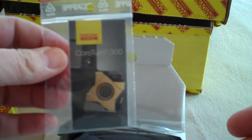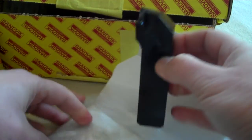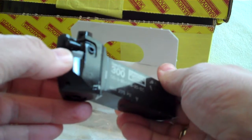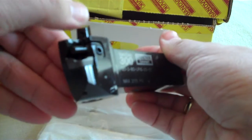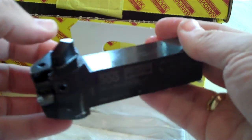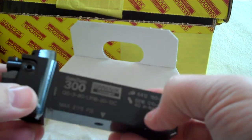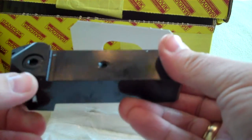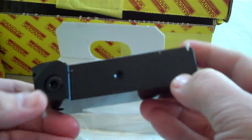A little instruction manual and the tool itself. Here's the unique shim with the under coolant, and the over coolant jet nozzle up here. The part number is laser marked on there, with the screw and pin to hold the insert in. Max PSI 2175. You've got access to the coolant line in the back and from the bottom.